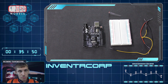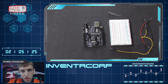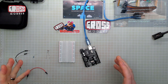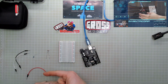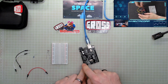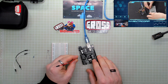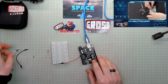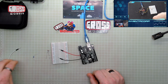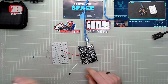So this is going to be the start of a new day, new week, and this week we're going to be trying to get your charging systems working. Today I'm going to be working over this side of the board instead of the other side, because we're not dealing with the digital input/output — we're dealing with the analog ones, which are the little ones down here. So we have, as ever, to get the power, and we're going to get that from that side as well. We'll get the ground from over here — there are two marked ground — and we're going to use A0 as the signal.